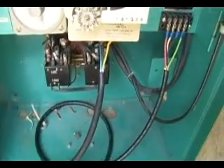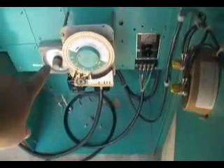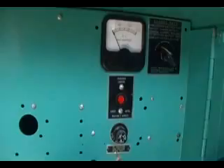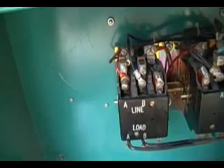Normally there are these two contactors down here. The one on the left says line and load; the one on the right says gen. As long as there's electricity available where it says line, everything will work. This timer lets it run a certain number of minutes for exercising. That's a charger for the battery, because the battery would always be hooked up over here. Normally this switch would be set on automatic.